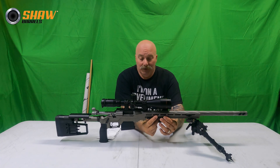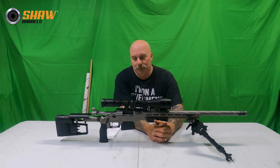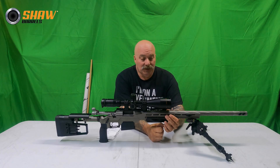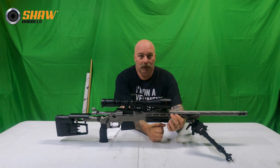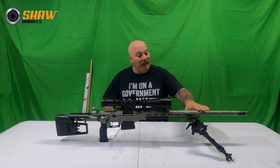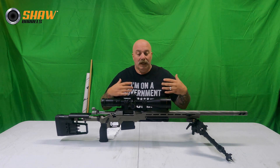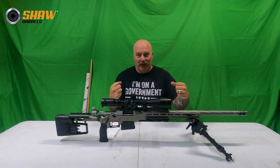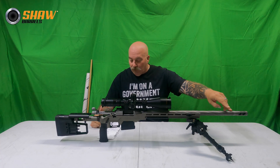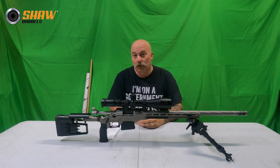I'm not sure how dramatic the taper is — I've never seen one in the blank — but I do want to have more conversation with Shaw. I'm thinking about doing a YouTube live where we can answer questions and maybe they can bring barrel components and we can talk about it. Once I get back from Wyoming, my 7mm Rem Mag will be getting re-barreled with one of these. The stainless barrel sits inside a titanium sleeve that is press-fitted onto the barrel, with a stainless nut that is rock-set and torqued to spec near the muzzle.